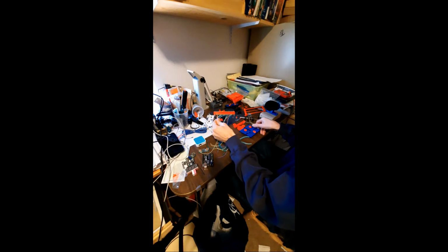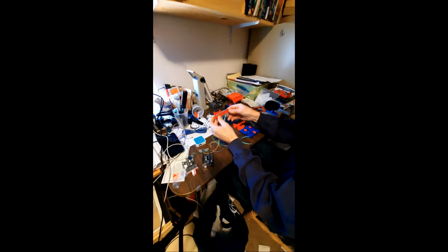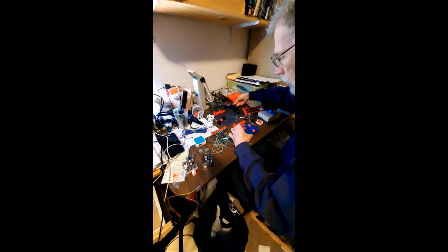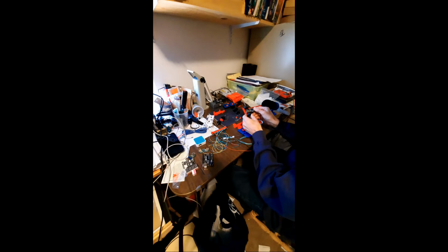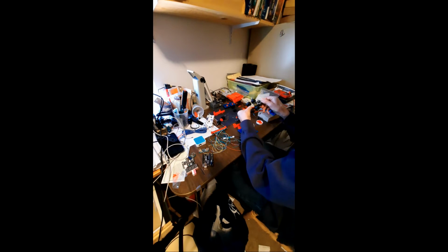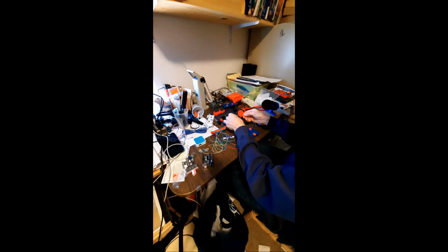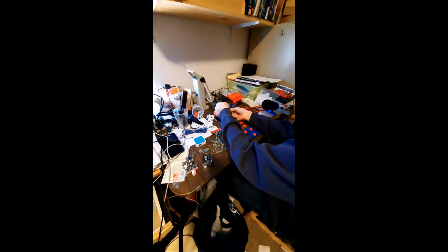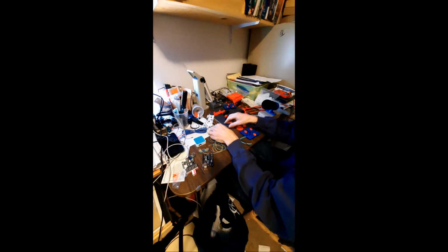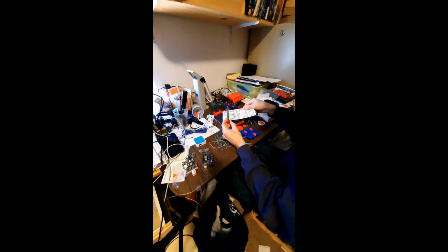Now that we've got this put together, all the wiring done, this being the core of the overall module, we'll start the assembly by putting those inside this frame here. So you can see all the parts on the table here, the motor and its wheels used to pull the card through, its corresponding idler wheel on the other side, and that's attached by means of some gears that go across to the other side to attach to this, which is attached to its idler wheel to pull the card through the rest of the way once it gets through these here. And this is the way the card goes through.